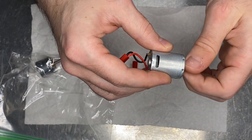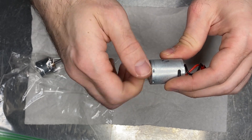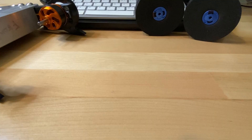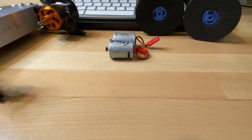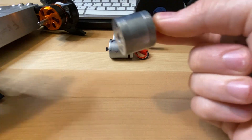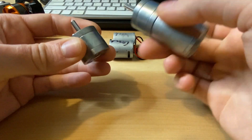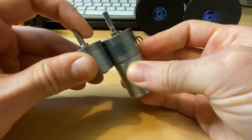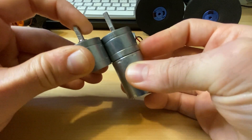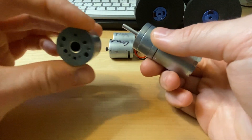I think I'm going to order some more motors if I can — gearboxes too, but probably not from the same place. Here are the original good and bad motors, and then I found very similar motors: same size but the gearboxes are actually a little bigger. They still say a thousand RPM, or 970 somewhere thereabouts, but it's actually a slightly taller gearbox. From looking inside, it looked like it had an additional gear stage in there.